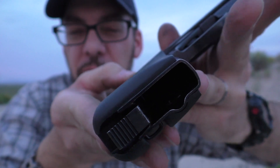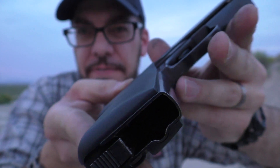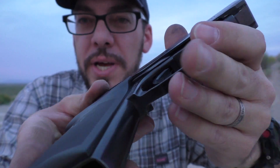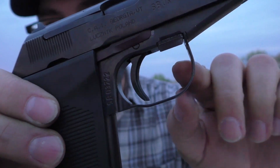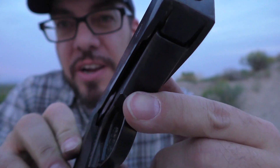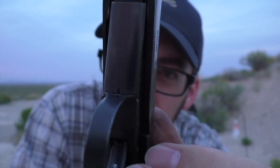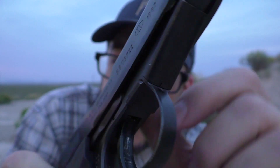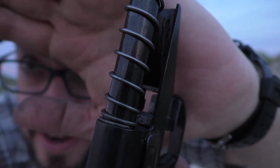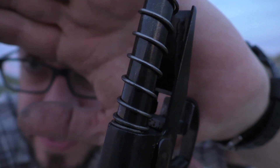What immediately caught my eye about this gun, and what really sets it apart from a whole lot of other Makarov-like pistols, is the frame. The frame that this gun is actually built on is completely made out of sheet metal. Look at that trigger guard — that is very much a sheet metal trigger guard. It's very clear. You can see all of this piece under here, and you can kind of see where they've ground away the weld. If we take the gun down, you'll actually be able to see that much better — there's a little bit of a weld mark which on the outside was ground away, but you can see it quite clearly on the inside of the frame.